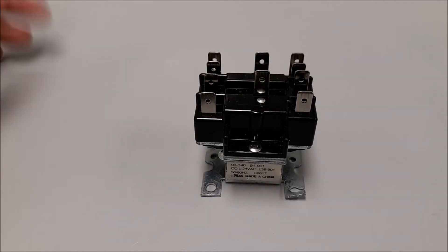What information do we need to know about a relay in order to replace one that you've diagnosed as bad? Anytime you do a replacement, there are things you need to know about the component in order to match it properly. The first thing you need to know is the coil voltage — we typically use 24-volt coils in our field to control the switches.